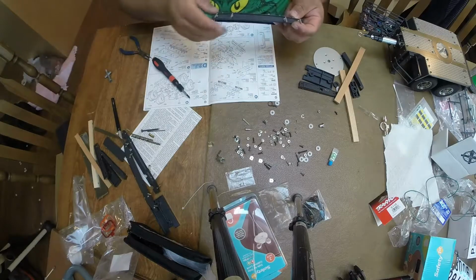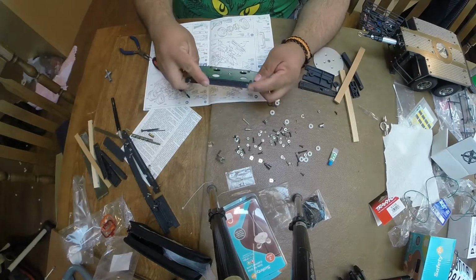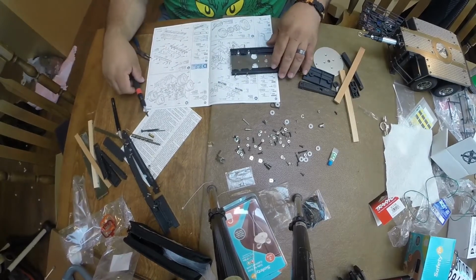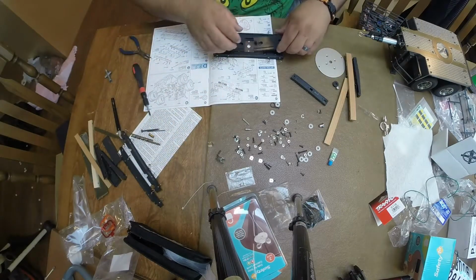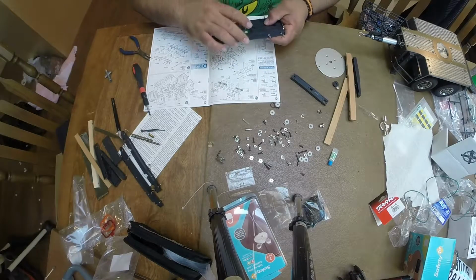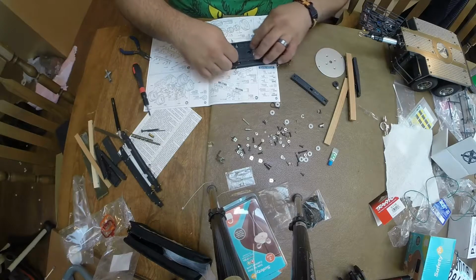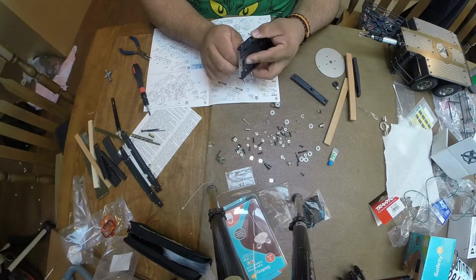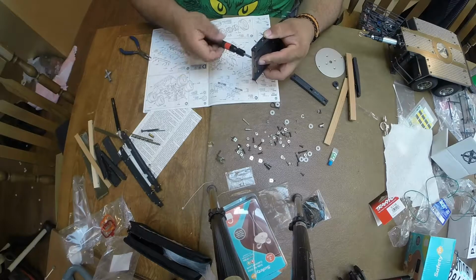Turn that off before I forget. Alright, so you end up with something like that, and you have all your screw hooks pointing in, because when you wrap the chain around, you don't want the chain to come loose off of it. So once you've got those done, you grab these guys here, like so, and they sit like this, and they're sloped. You can see they're kind of sloped, so that way they take the slope out of the bracket. And those are just held together on the outside with a single lock nut or a flange nut and an MB14, which is your 3x8, which is what everything else is held together with so far.